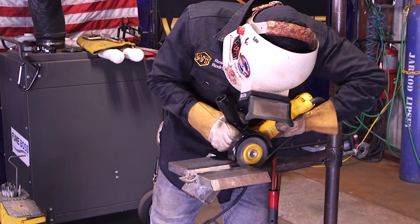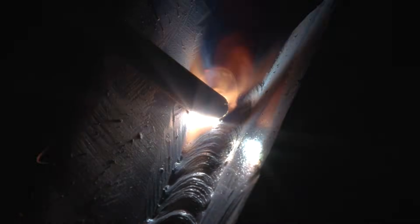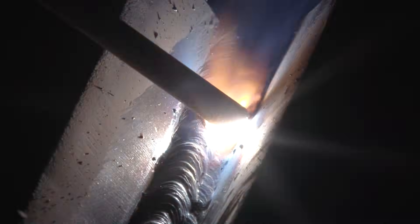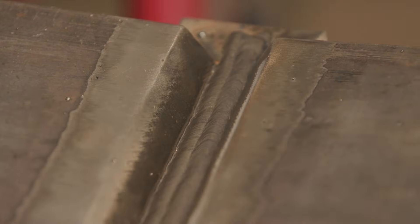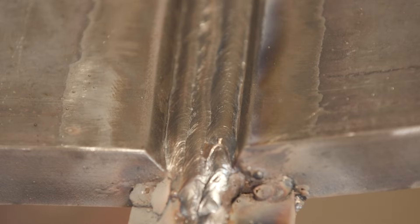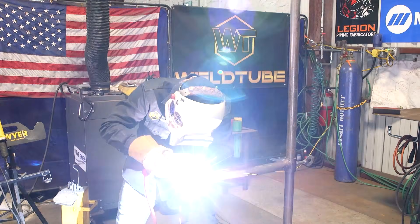We're going to keep flushing it out all the way to the very edge until it's full. From this point, you can actually start doing your stringers. We're going to have our puddle roughly an average, and meet up halfway of our very first fill. Then we're going to do the one on top of it — same concept. Meet up 50% at the bottom, and make sure the top edge of our puddle touches the top one. Sometimes you might see that you're putting more metal on one side than the other, and you're going to start stacking or growing uneven. It's not a problem — do not worry, do not hesitate. All you got to do is even it out. Now we are done with our fill, nicely flush and ready to cap.